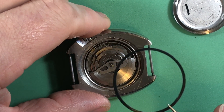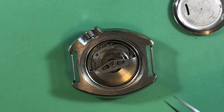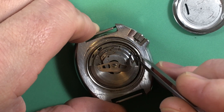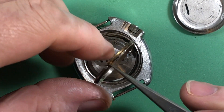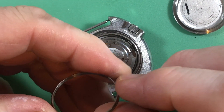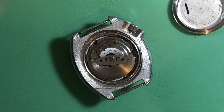That sealing surface looks decent. Isn't that amazing — this used to be a regular O-ring gasket, not a flat one. We obviously had a little moisture in here — we've got some scunge. It looks like we definitely have some corrosion in here. Most of your movement ring spring is missing — there are pieces of it, but that's junk. That's going to require some work.